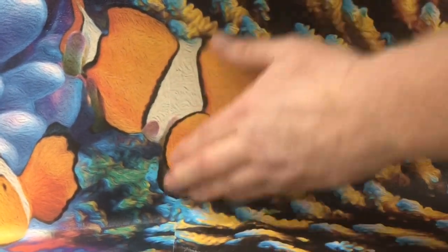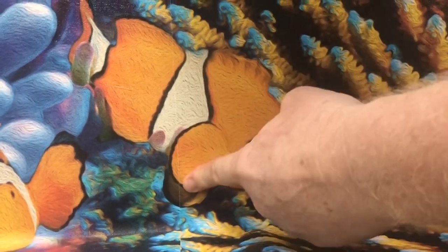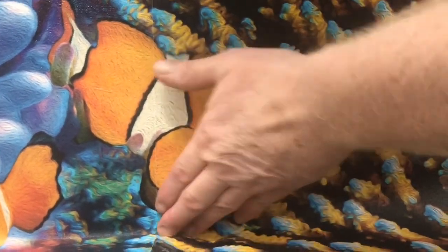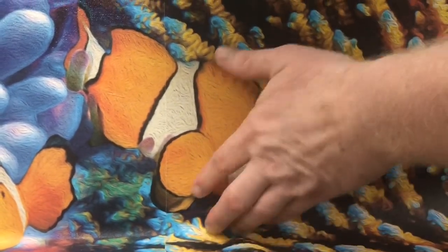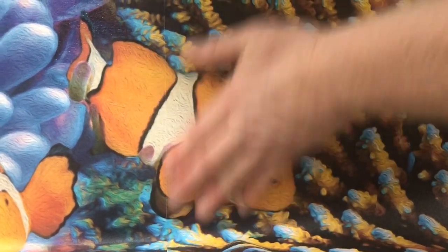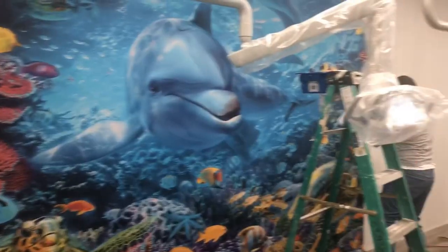Usually, paper hangers let the pattern deceive them, and then they tell the owner, well, your pattern was off. No, they were off, because they let the pattern deceive their eyes and understanding. Meanwhile, all you gotta do, especially with these rounded pattern matches, is go like this, to the left, to the right. And you can see once again that we have a perfect match.